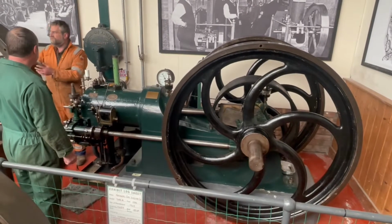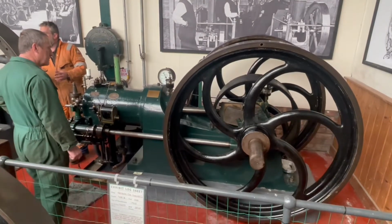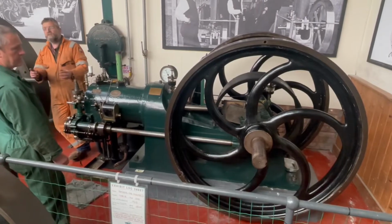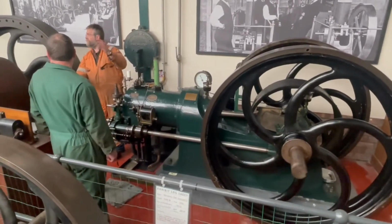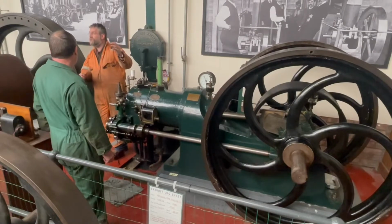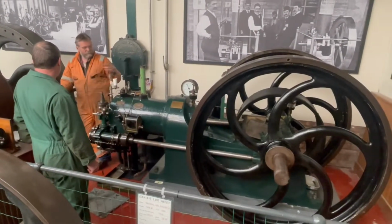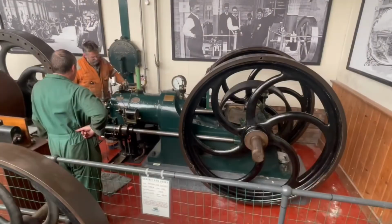Quite a lot of the engines you can see, the others we started, are a bit more refined than this. They have a special cam that will admit the air at just the right moment. Because if you admit compressed air and just leave it on, the piston will go down to the bottom of the bore and then it will just stay there. So instead of that, you've got to admit compressed air, blow the piston down the bore, and then turn it off quick so it can come back and start its oscillation. On this one, which is the sort of comedy engine, the man has got to be the valve. Right, here we go.